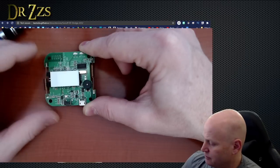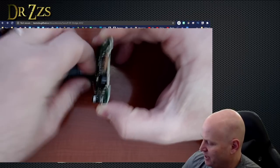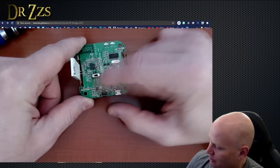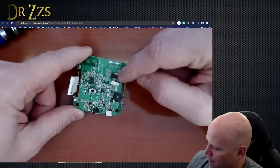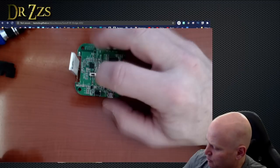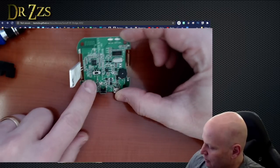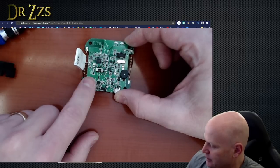So here's this RF bridge. It's got this little LED on it and this little foamy guy. You can just peel that guy off. There's a switch here. The switch has an on and an off, and this is what separates the other chip, which I believe is this guy over here, the RF chip communication. So when we flash this initially with Tasmota, I'm pretty sure we want this off. And then the pins that we want are these pins underneath this LED.